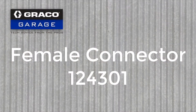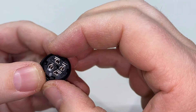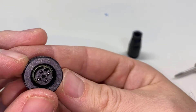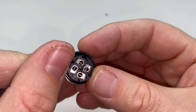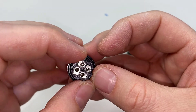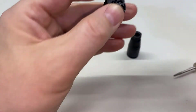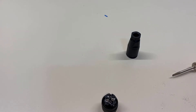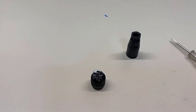Let's take a look at the female connector now and see what the differences are. The main thing is that it's going to be a mirror image inside — pins one, two, three, and four will go counterclockwise instead. Here's our keyway. The male had the key, so now the female has the keyway. There's number two, which means number one is here; number three and number four across from number two. I'm going to get my black marker and make a mark, then use my paint pen to mark number two for white. I'm just showing you both options.